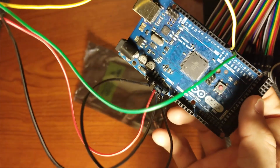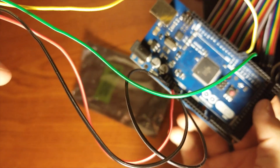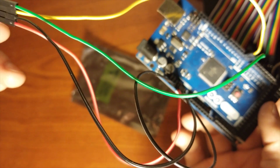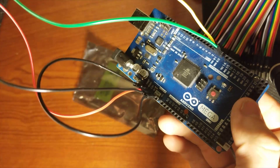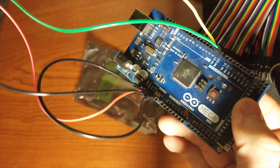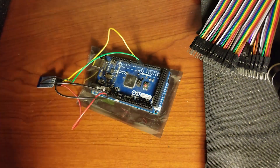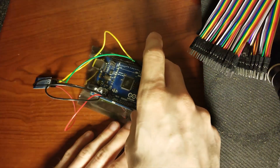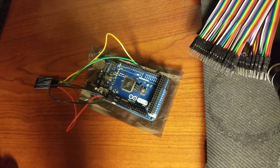So in the end, what we're left with is one wire from VCC going to 5 volts, one wire from ground going to ground, TX going to TX, and RX going to RX. Just like that. And essentially, once you've done that, you've got your reprogramming Bluetooth module. But now you're going to have to plug it into your computer.